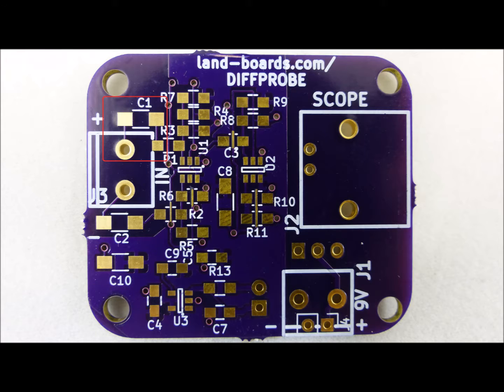We shortened the etch length from the input connector, as you can see at top with C1, to be quite a bit shorter into the capacitor, and out of the capacitor into the resistor was also made quite a bit shorter. That solves some of the issues we were seeing last time. We put ground rings around the places where the feedback resistor and the input resistor meet, and the other things in that circuit as well, and then stitched it to ground all the way around that part of the circuit. Also, the input stage is completely free of ground and power planes.